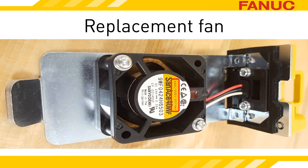The fan and the metal plate it is mounted on are two separate parts. The part number of the fan will probably start with A90L, and chances are good the part number is printed on the fan. If it isn't, contact our parts sales department. Give them the part number of your servo amplifier — that's the A06B number on the label at the top of the amp — and they'll locate the part number for you.